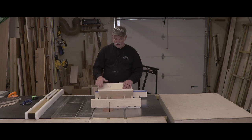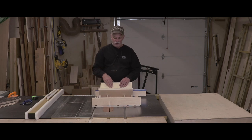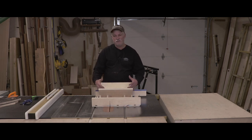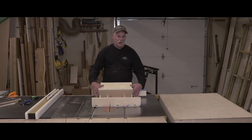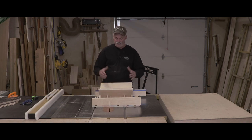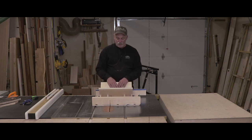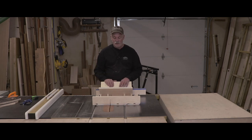So there it is, guys. In hindsight, I really wish I would have added a piece of T-track to this face, and I may still do that. It's easy enough — just a three-quarter inch router bit, set it up on the face, and set the track in so that you have stop blocks along here. For me and what I do it's not that big of a deal, but you might want to consider adding that T-track. That's going to wrap it up for this one. I hope you got something out of it. Let me know if you built it, join my forums and show me your projects, hit my Amazon affiliate page — there are so many ways to get a hold of me. Until the next project, take care. See you next time.